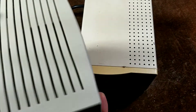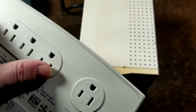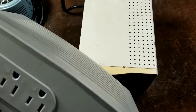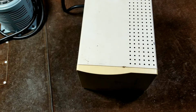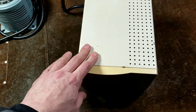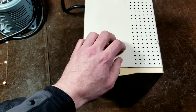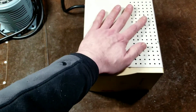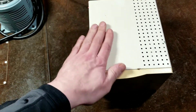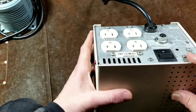The newer units are more bulbous — a sleeker office equipment style — but I don't like them nearly as much. This older model is a steel case, really heavy duty, squared off so you can set things on it or stand it on its side. The newer 1200 watt only has two lights even though it has two boost and two drop stages, whereas this older one has a light for each individual stage. I also don't like the integrated receptacles on the newer version because they're standard household grade and can't be upgraded.